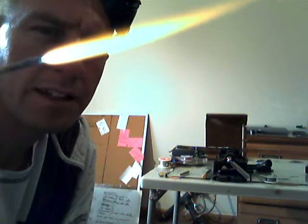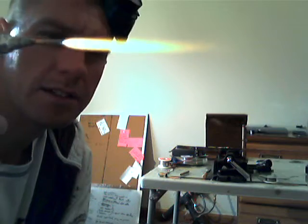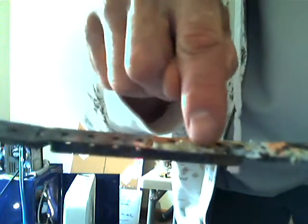You can't see it, but there's a tiny white hot blue flame right at the tip — about an eighth inch long. At the tip of that is the hottest point. The braze that yielded was far superior to the hydroxy alone. The metal flowed a lot nicer. As before, I was getting these big blobs with just oxyhydrogen. That's a really good braze right there, in my opinion, for someone who can't braze.